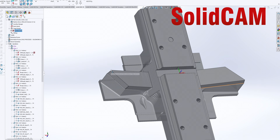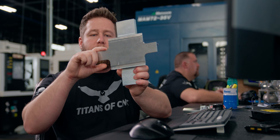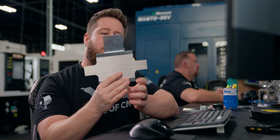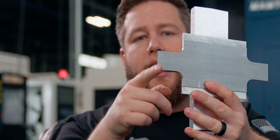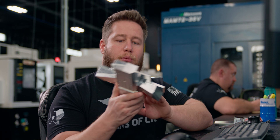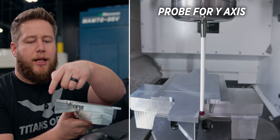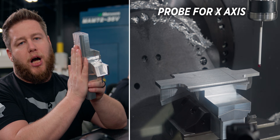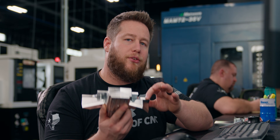Now, remember that square I mentioned that's just a little bit larger than the Chevy emblem? I'm using that to probe for this last operation. On the first op I dropped down with an end mill and finished three sides on both sides of that square, making sure it would be centered where I wanted my work offset. So when we flip the part over, I can probe those two lines to set my rotation, then probe for Y and X. Z comes off the bottom, so without this reference I really wouldn't have had a good way to set my work offset.